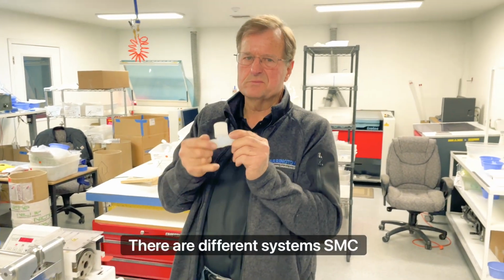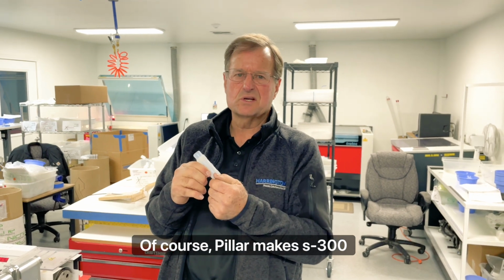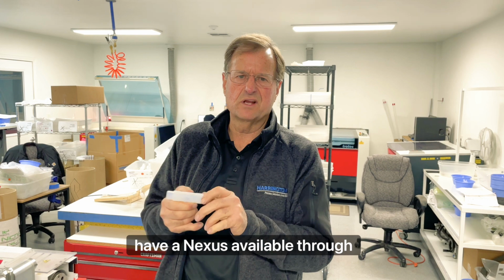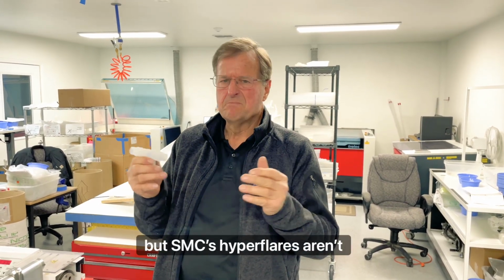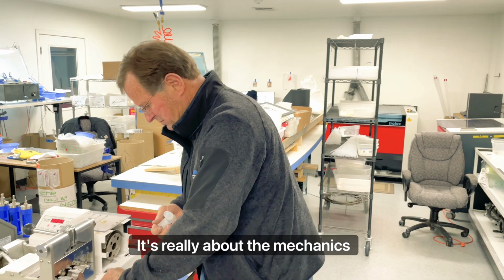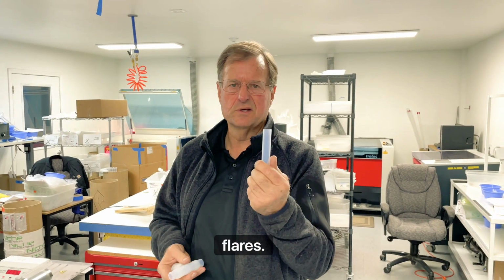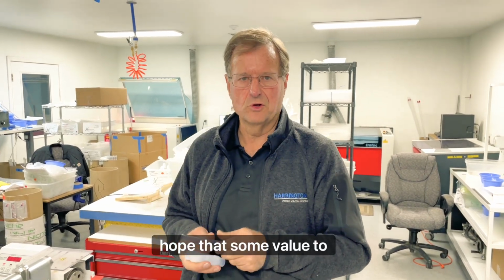there are different systems. SMC makes HyperFlare, of course, Pillar makes S300. We now have Nexus available through Fitline. So there are other methodologies, but SMC's HyperFlare isn't necessarily better than standard fine thread flare. It's really about the mechanics of making good craftsmanship and using good flares. So that's my message for today, and hope that's some value to you.